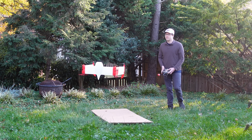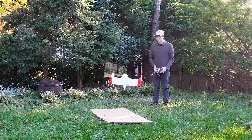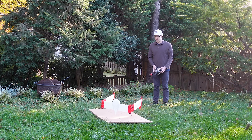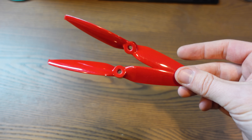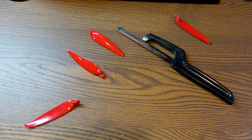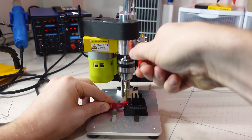You may have noticed I mentioned folding props in the design, but I didn't use them during those first hovering flights. For the life of me, I can't find anyone who sells counter-rotating folding props, so we needed to build some. I took regular props and cut them diagonally across their hub, then filed out a square groove and drilled a hole through the remaining hub pieces.